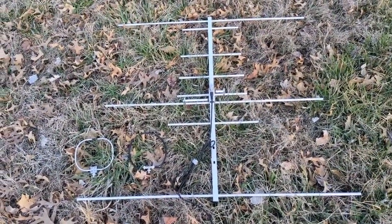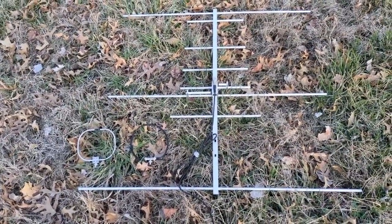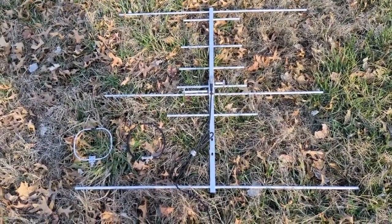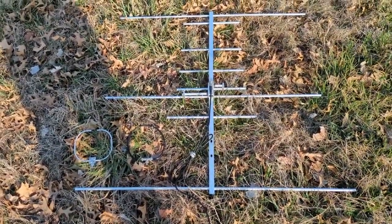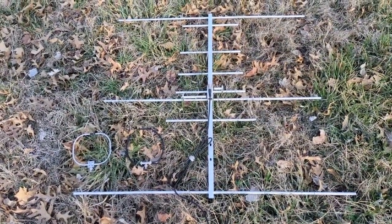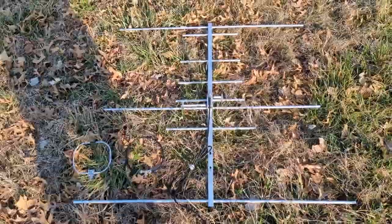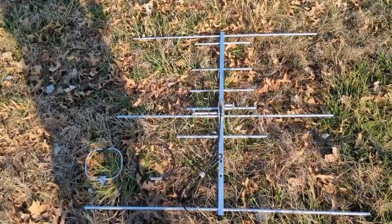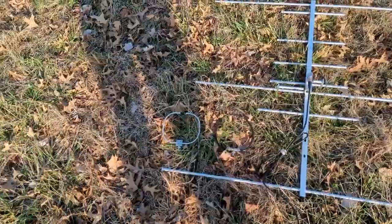Comparing these: the big Yagi antenna is also usable for transmit and works both ways. It receives better in the direction it's pointed, but it also transmits better in that direction. The gain depends on the band — the more elements you have, the more gain. The big three-element one is going to be around seven or eight decibels of gain, and the smaller one probably around nine. The key point is there's one direction you point it that gets the most reception, and that's how you use it to find where signals are coming from.